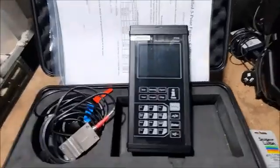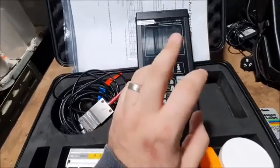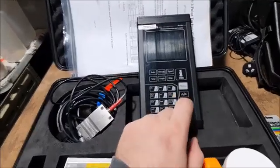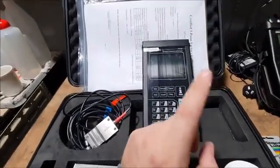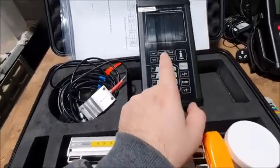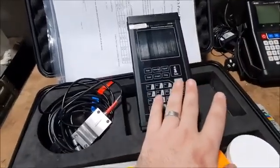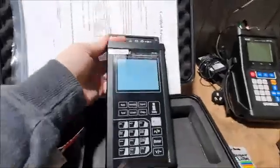Okay, now there's a couple advantages of the P118 over the P117. So that'll be that this is a better technology. It's PicoFly technology, which offers increased accuracy. So it'll be 0.5% accuracy rather than the 1% of the P117. It can work with higher velocities, so that's up to 12 meters per second on this model. It has better repeatability at 0.15%. It can work on larger pipes, so this will work on pipes from DN15 to 6000, and also it's color rather than just black and white on the display.